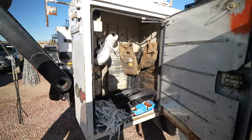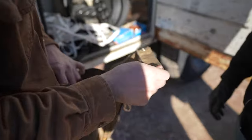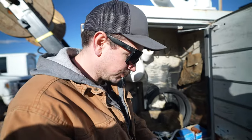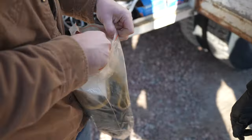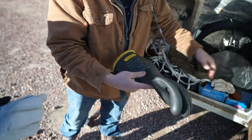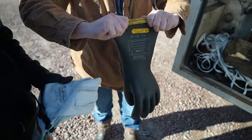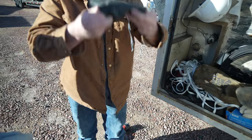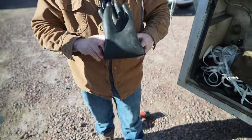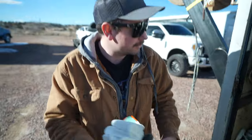These might be electrical gloves - yep, these are electrical gloves. So these are very expensive - you use these for working on voltage. So those are the outer gloves, and these are the inner gloves - this is actually what protects you from getting shocked. These things are supposed to be stamped every six months. But you can see if they're still good - you go like this and listen for air leaks. You can tell if they're good or not if they don't have any air leaks.